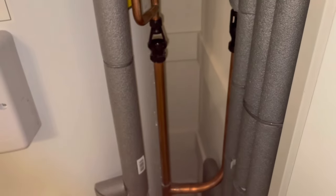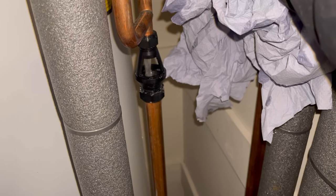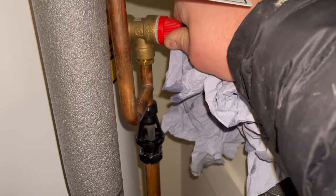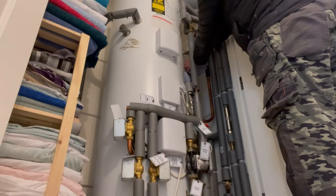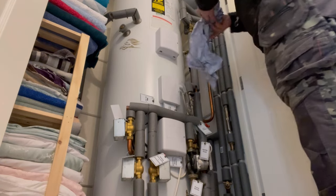This one here is the temperature relief valve, which is actually attached to the cylinder. The other one is on the pipework and that just does the pressure - well, they both do pressure, but you have two separate ones. When you are opening them up full, you need to click them over.